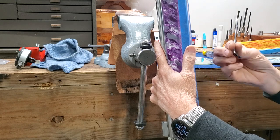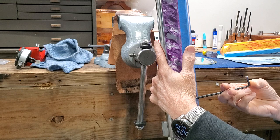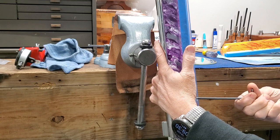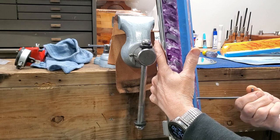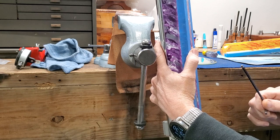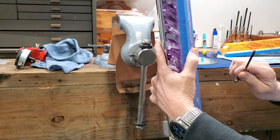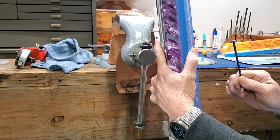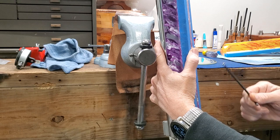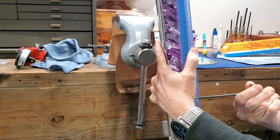Take your wrench. Take it with the short end out. That way you don't have a lot of leverage. Now watch. What I'm saying is I'm going to add to it. When you break the screw loose, the same way as when you tighten it, it should be a solid snap and a hard set into place. When you break it loose, it should do the exact reverse.